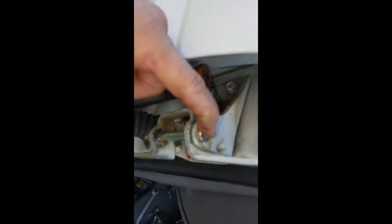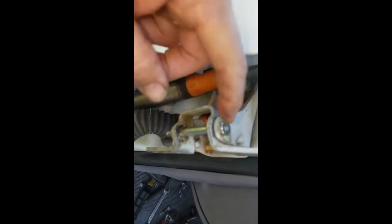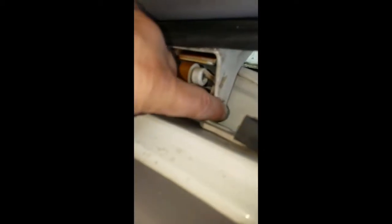The problem we're having is that this door pin is really proud. I replace these on the top and flip the pin around so that the knurled end is on top. The way it was from the factory it had a pressed-in, crimped top. On the passenger side you can see it's just the opposite where the knurled part is on top.